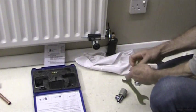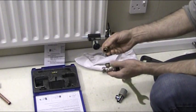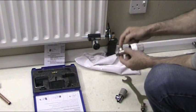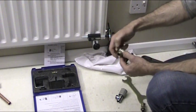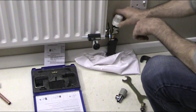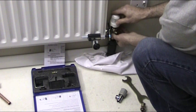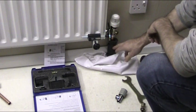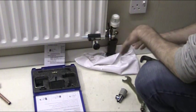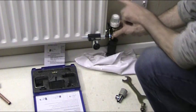Now when you do this you must check the tail — there are two types of tailpieces: the three-quarter type and the half-inch one. These are usually always connected to the TRVs — the thermostatic radiator valves — so we can leave that one inside there and reconnect it. Similarly with the inlet nut: we know it's 15mm, so we can take the nut and olive off and use the existing one. Now we need to refit it — simply drop the valve on top, finger tight with the nut at the bottom. It's also worth bearing in mind that when you put the freezer kit on you've got about 45 minutes of working time, maybe an hour depending on room temperature, so you've got to be reasonably quick. Get everything set out before you start. Now that's on there and we can swivel it. We need to reconnect it to the tailpiece of the radiator, which is still full of water.